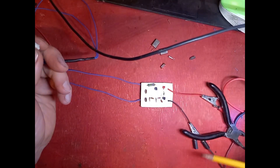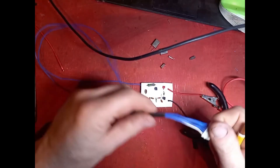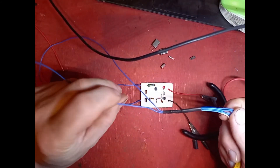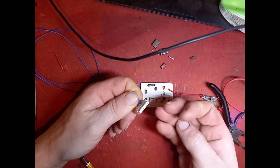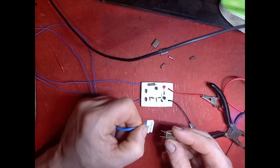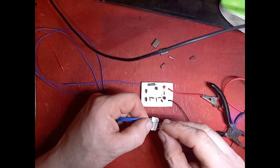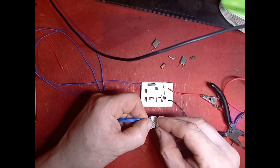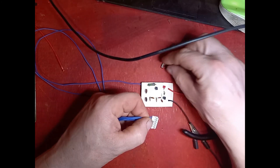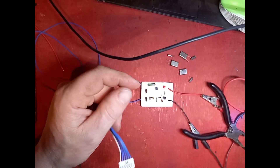As you can see, I've got it hooked up to my benchtop power supply at nine volts. On this wire here, it's a connector from a TV and it's got six wires coming off — I've joined them into two, so I can effectively use all six holes to put in a crystal. On the back here it's open, so I can actually touch it on for a quick test. You could mount it in a box. Just touch them on many old crystals — it's a quick go/no-go crystal tester.